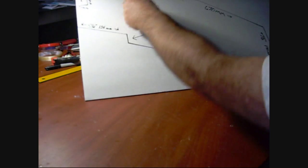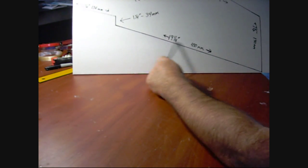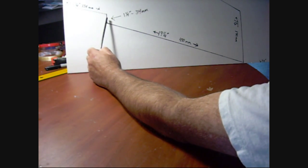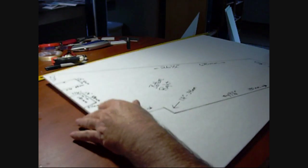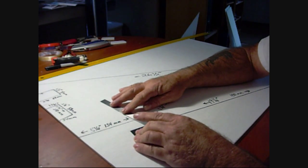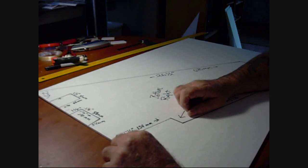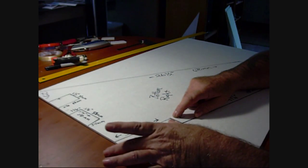Just to highlight quickly: 26 and a half inches at 62 degrees, you should come up 90 degrees at seven and a half inches, then 74 degrees from this corner, up 19 and a quarter inches or 490 millimeters. Then 97 degrees up — that's that warm temperature — 97 degrees up. Then when you get your eleven and a half inch measurement down to here and tie it into this, you'll be right. Now that cutout there is for your prop, right here.